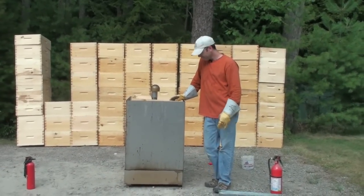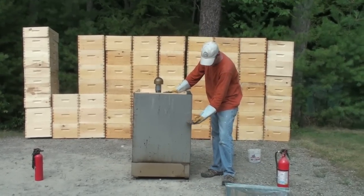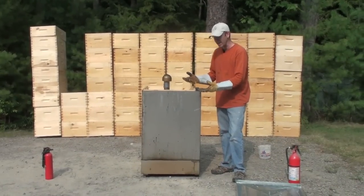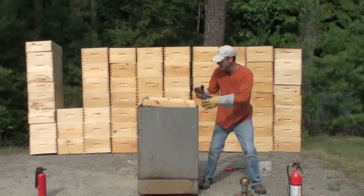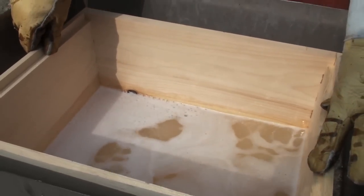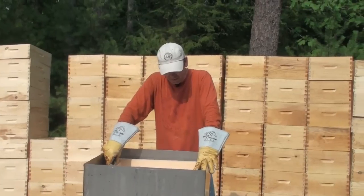One concern with this whole thing is it's going to foam. You're displacing moisture that's in your wood, and the more moisture there is, the more foam you'll have. My wax level is here and I gave myself a good foot of headroom for foam, because if it comes up and over, then you have a flame issue. This wood is pretty dry — it's been inside — so it's really not foaming much, but that foaming is how you know it's working: good temperature, cooking the moisture out, which gets replaced with wax.